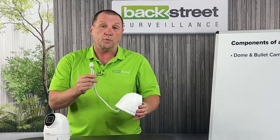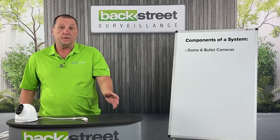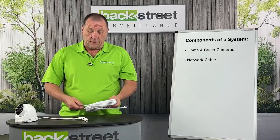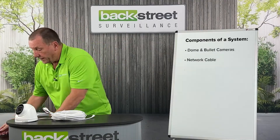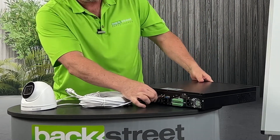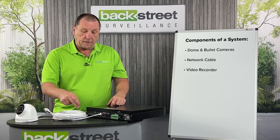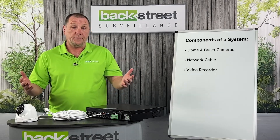The pigtail is the sensitive and weak spot of a security camera, so we have to protect it. To communicate the camera video signal and to power it, we use a network cable — this is a CAT6 system with RJ45 fittings factory-put on each end. It's as simple as plugging one end into the camera, running it to the video recorder, and plugging it into one of the PoE ports. Power transmits from the video recorder through the cable to the camera, and data transmits back. That's the only wiring required — very clean, which is why IP-based systems are so popular.